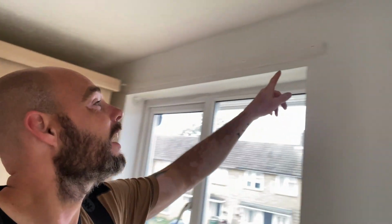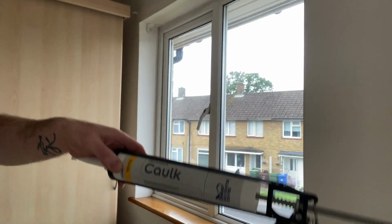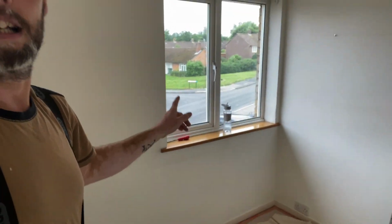Happy days. So, for those sat in your house watching this video going, do you know what? This room could use a lick of paint. Here's what you do. First things first. Anywhere where there's gaps and cracks, I go around first with a bit of decorator's caulk and get that done before I get set up, because that way it's curing and drying off. So all around the windows, ceiling line, skirting edges, around the architrave, anywhere where there are those cracks, get that done.